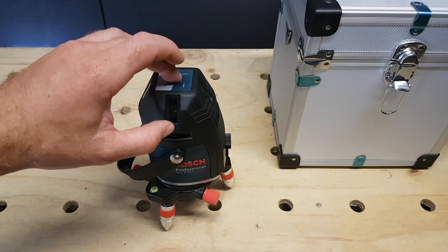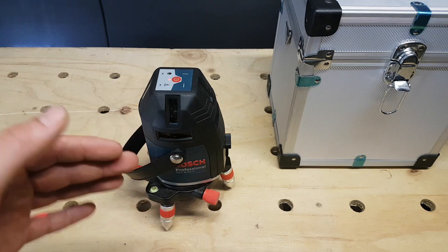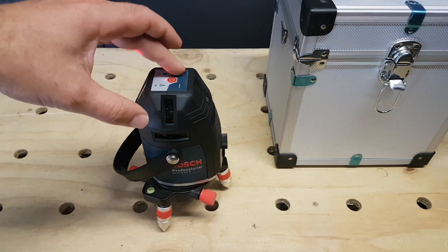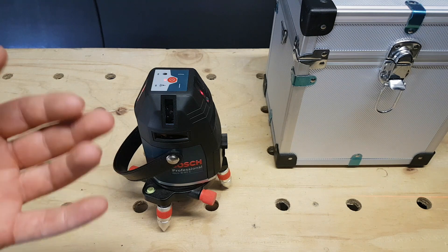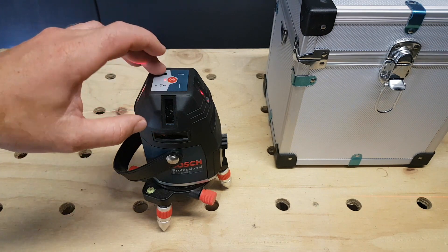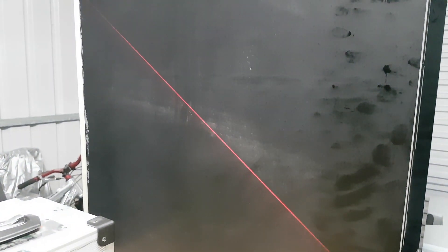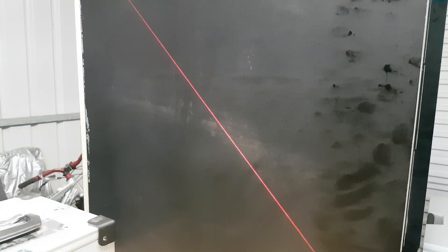This also has a lockout function. Not only is it great for both vertical and horizontal lines, but when you're on a job and you need to set something up on an angle — a staircase or a handrail, for instance — you can press the top button and lock out the laser at whatever degree or angle you're after and follow that without having to worry about it.